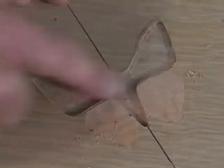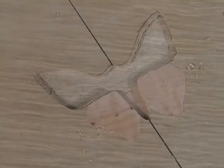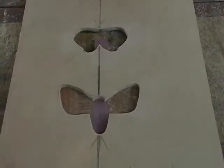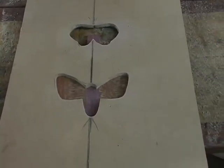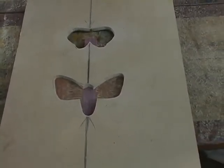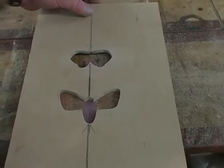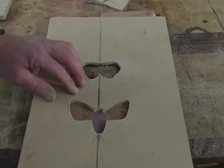So now we have the void with the second cut. We've cut through our original inlay, and now we just have one more step — make the butterfly's wings and its body. I'm lining up the body. Because it's a straight edge, I'm just guessing at the middle of it. I'm watching how much of a gap the sycamore is on either side of the lower body, and watching the head to see if the two points are just about the same balance. Sort of centering it.